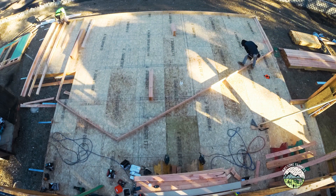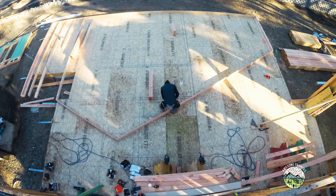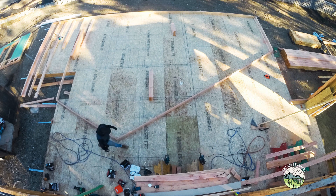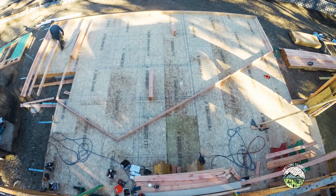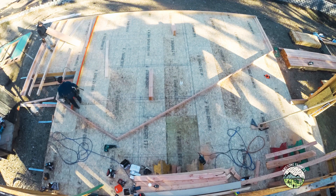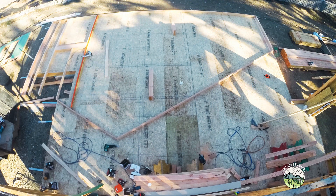Starting on the left, that's the two-story high wall that will have rafters land on top of it upstairs. You can see we use 4x10 headers — we put a plate top and bottom — because the walls are 2x6 thickness, and that gives us nice full bearing on our cripple studs.